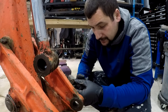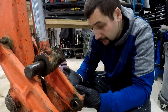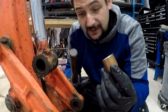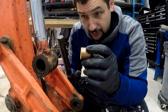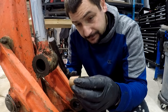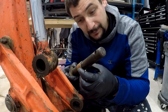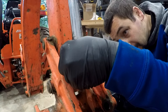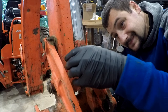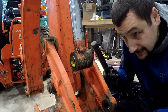I'm going to go ahead and double check the parts list. I mean, it's super sloppy, so I've got to figure it out. The only thing I could figure is that when my brother replaced that H-Link, somehow this bushing fell out. There's two - one in each side. And they seem to fit over the pin with a little bit of play, but not much.